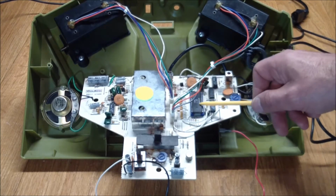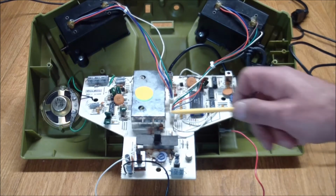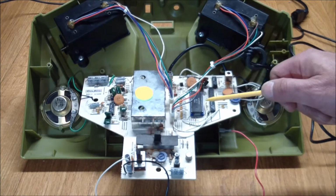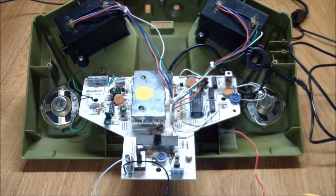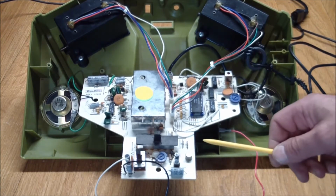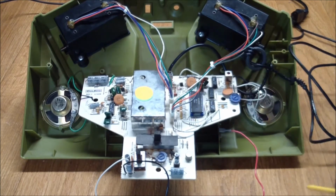And there may actually be other games in here than the 4 that this is playing. I'd have to have a look at the schematics and see where the select pins are and all of that. So there may be other games in here that you could modify this to play. But for now, that's really all she spoke. There really isn't any real voltage regulation in here to speak of, so this thing is running directly off the power brick, and there you go. If your power brick goes bad, the thing is going to start acting up and behaving strange.